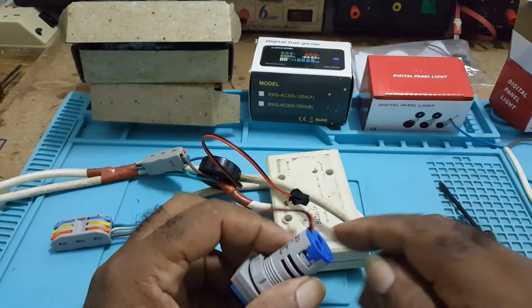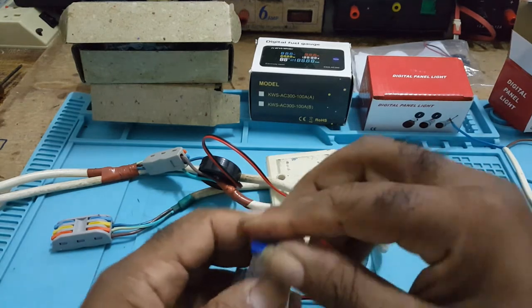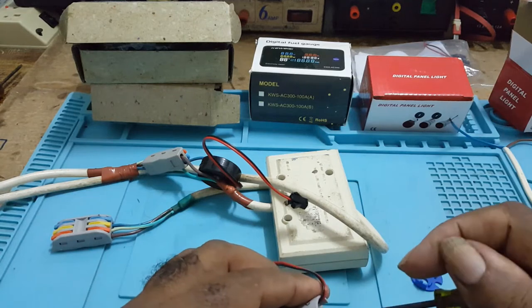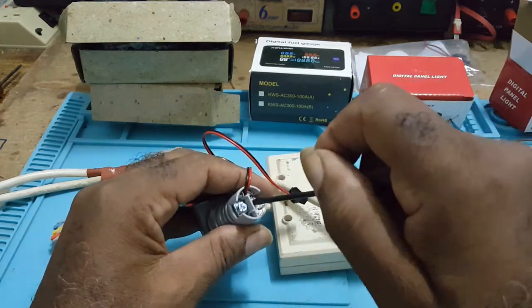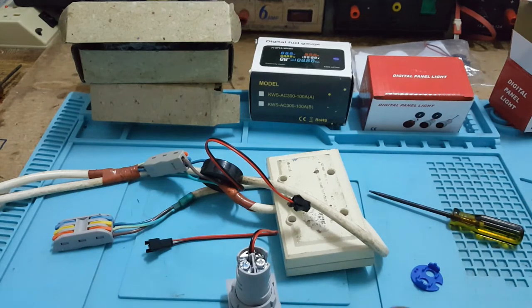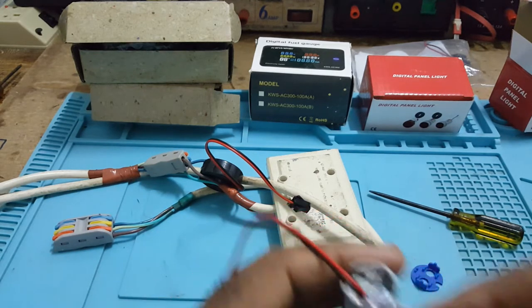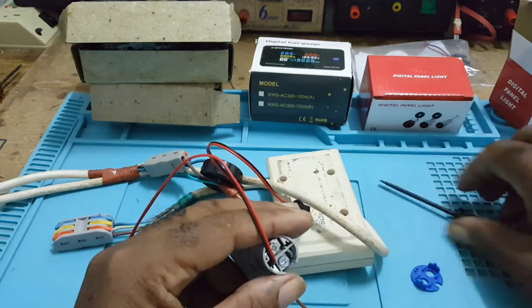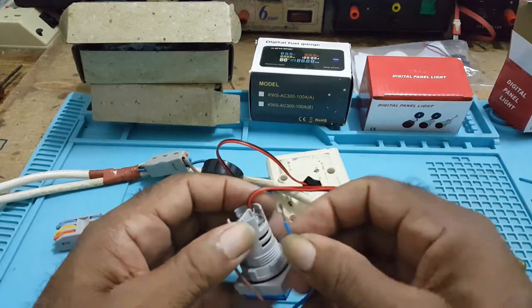You would connect your wires here. You just pull this and it comes out. Unscrew the terminal, which is a bit tight. Unscrew the other one. If you're not comfortable around electric, please have an electrician do the wiring for you. Plug. Make sure it's secure.